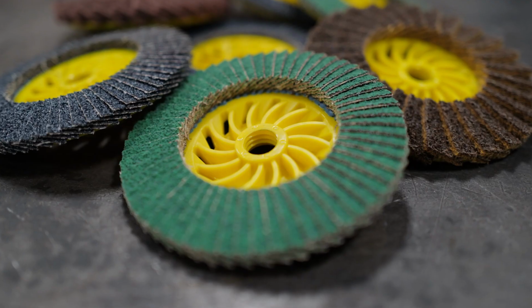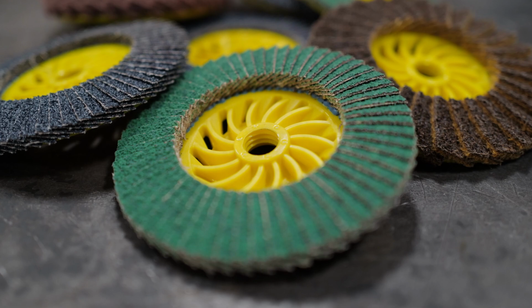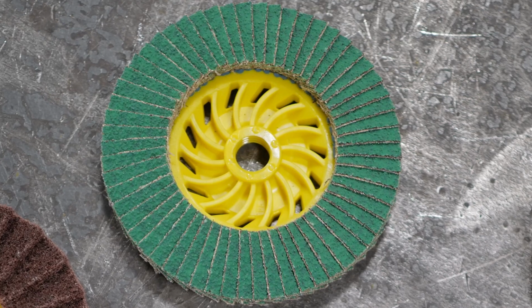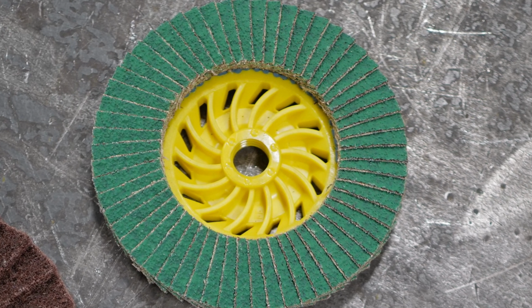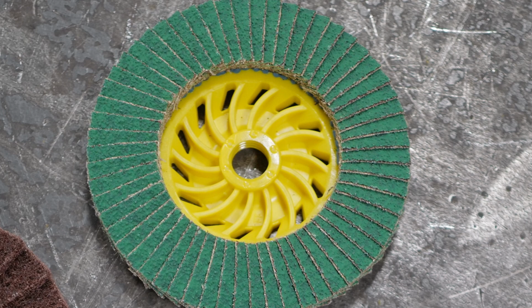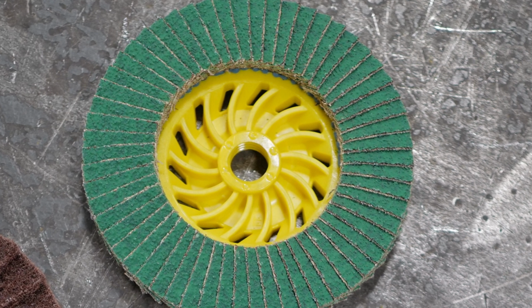We also have other varieties of Titans. We've got the green kind, which have a lubricant on them. These are really cool because they reduce the heat by 20%. Another way we reduce the heat is actually the top of the Titan. If you look at this right here, the top of the Titan has vents going through it. What that does is circulate air coming in, keeping your material cool.